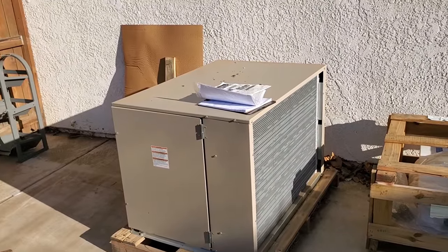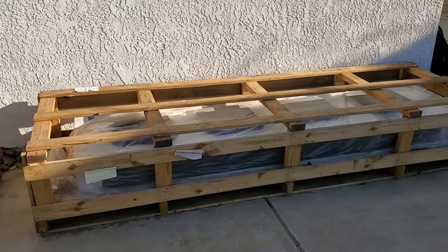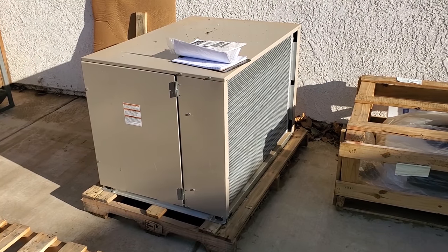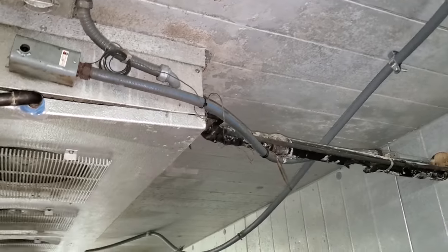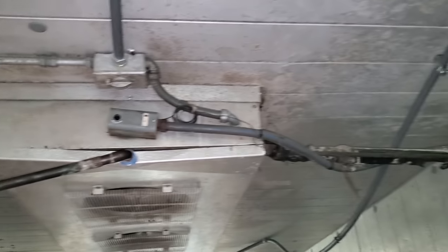The condensing unit itself isn't that heavy. It's just got a big micro-channel coil is all. So we're going to get over there and see what we got. We got an evap and a condensing unit, and then we'll have to run a new line set for the equipment. This is my evaporator. This is an old unit, but it's still going to go basically out the same hole outside of the box. This is a heatcraft evaporator, so it should line right up.